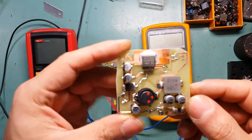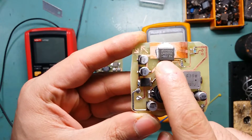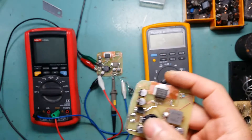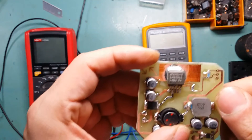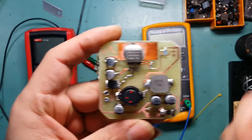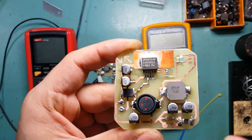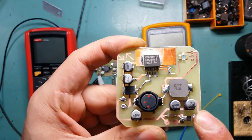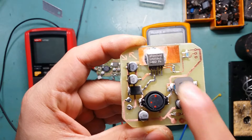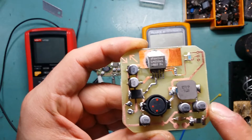And this is what I came up with. This is based on the adjustable version of the LM2575S, and I also have the LM2596S — they're similar and work the same way. I've tested this circuit and the ripple on the output is very, very low. The reason is I've got two sets of filters to bring the ripple down, one after another.